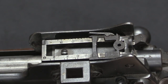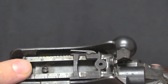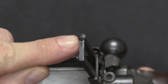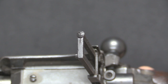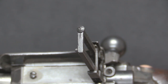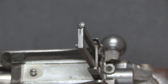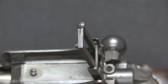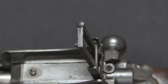I want to show you the rear sight, because this is the fine-adjust precision rear sight first adopted by the British in 1917 as a sniper's weapon. This little knob is your fine elevation adjustment — you can see three little lines marked on it. Rotating one line's width, or a third of a revolution, is a one minute of angle change. That was very specifically and deliberately done, and it's one of the few instances of really a modern level of precision in a World War One era sniper rifle. It was much more common to have a bullet drop compensator built into the scope with adjustments only by raw range.